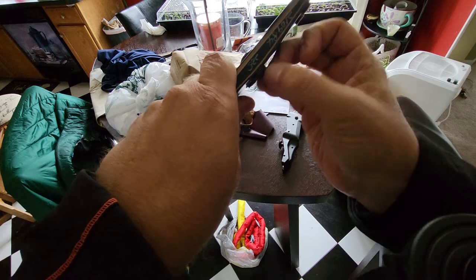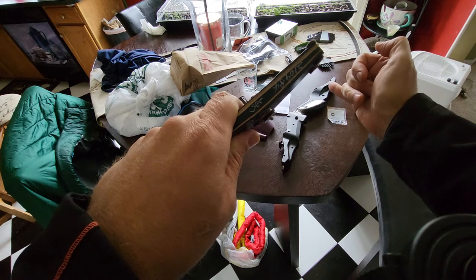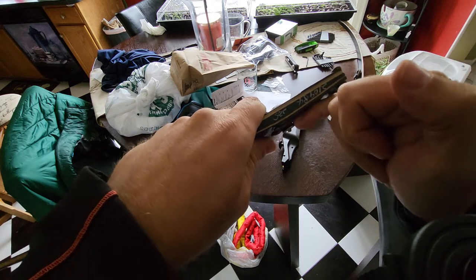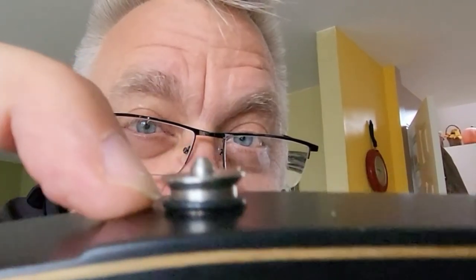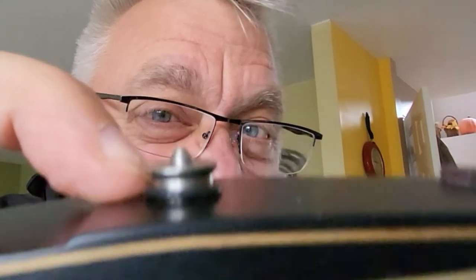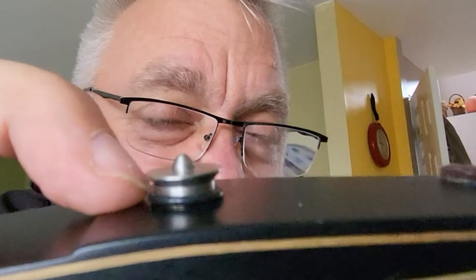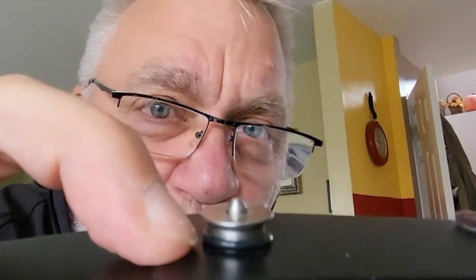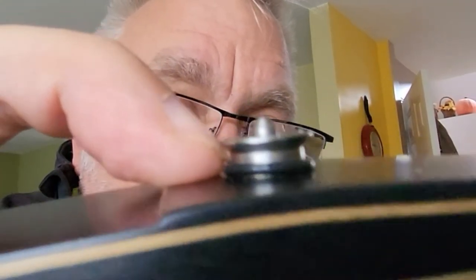So I've got to find a way to get them down because they've got to be between this piece and the mating surface right there — they've got to get in between and form a sandwich. Look inside here. You see how this one wanted to naturally go the wrong way down to the bottom? What if I stack two more up in there? That guarantees that one of them is up against this beveled surface, and then when I push it into the collar, the other two rubber pieces will separate and I'll still get a good connection. So I'm going to stack a total of three rings up on this pin and see what happens.